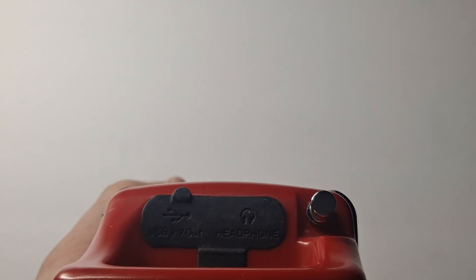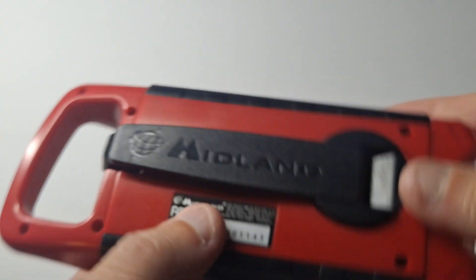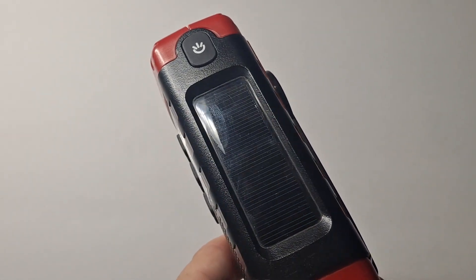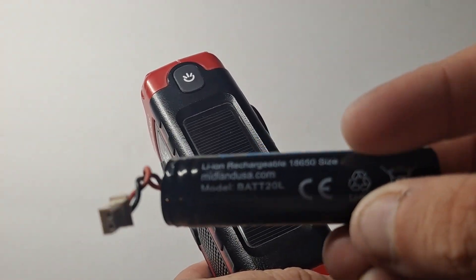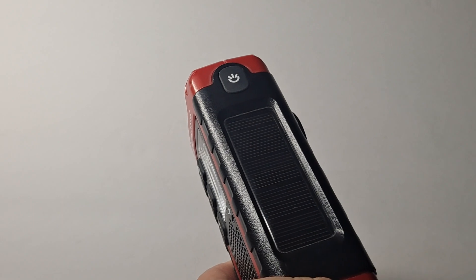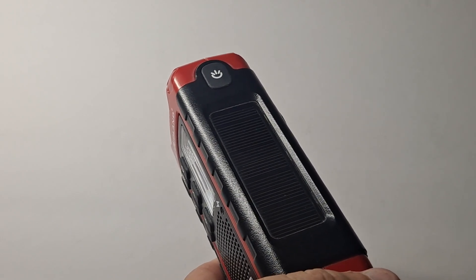You can charge the radio via USB as long as the internal battery is rechargeable — and all 18650s as far as I know are rechargeable. There's also a hand crank in the back; when the crank is going, a little light will light up to indicate it's charging. It's really hard to demonstrate while filming. And there's a solar panel on top — it takes about four to five hours to charge the stock-size battery. The one I have in here is listed as 9900 milliamp, so it may take a little longer, but I've got a whole box of them, so that's not a problem.